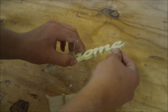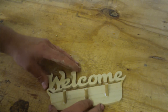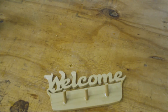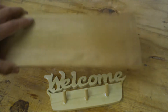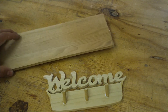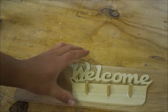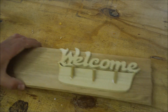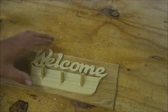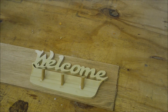Alright, in the history of the Country Scroller, this is not the first time I've identified a flaw that I made. I guess it was too flimsy and when I was driving in the pegs it just broke. So what I'm going to do is I have this cool looking piece of butternut here that's left over from something, and I'm going to glue this whole piece onto that — it'll be square and cool looking. So I'm going to go ahead and cut that piece out, sand it, and glue it to that.